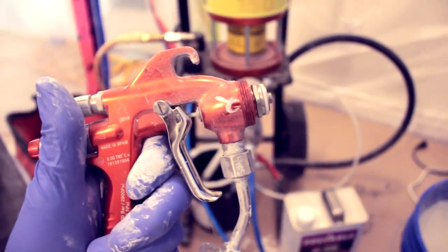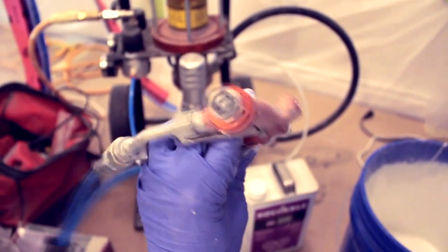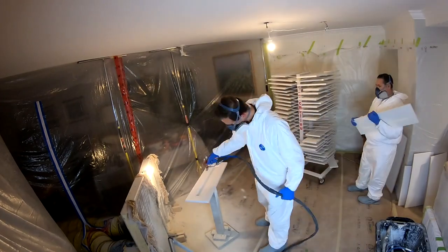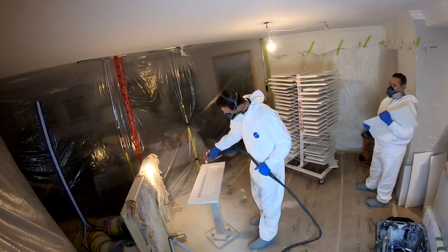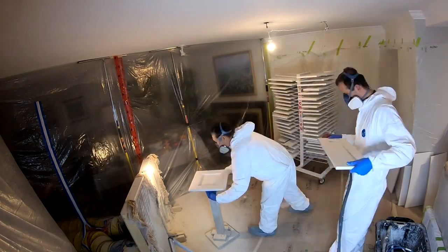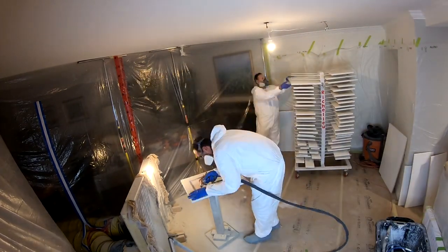This is the gun that comes with the Cigola system. I love it so far — maybe I'll do a quick review in one of my next videos. Then we started spraying the face side of the doors. We always spray the back side first, then spray the face, and leave the doors facing up overnight so they dry completely before we put everything back together.